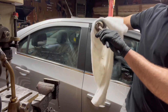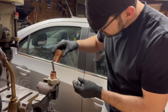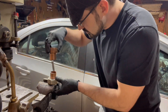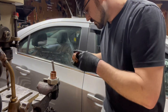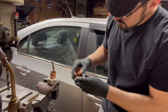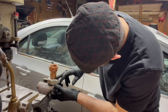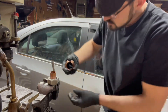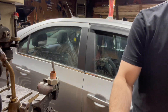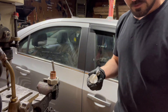Let's get the flux off here. Final piece here — make sure it fits a little snug at the top. Make sure it goes all the way when we go for it. I'm kind of setting it so that the nut is blocking it. I've only got a quarter inch between my previous joint and my new one, so be careful with the flame on this one. This is a lot of copper, so it takes a lot of heat. So, put the flux on it.